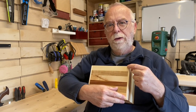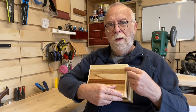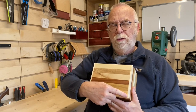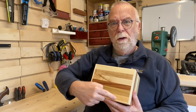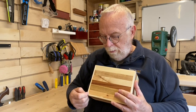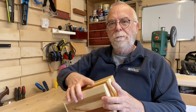If the gap was at the top you measured it, marked it on the bottom face, took it to the tracksaw and cut it — the idea being to get it already in line with the bottom edge of the rebate, hopefully parallel to the inside, so you had a long side and short side fitting snugly in the rebate. We did that until all four pieces fitted in snugly, then did the other side, put the two together and clamped it closed.